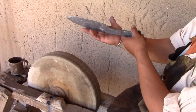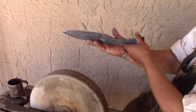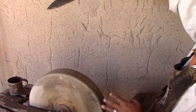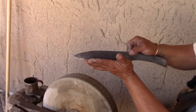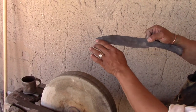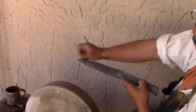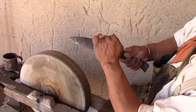You have to take into account the latent heat of the material. Once I get it to a straw color, I'll grab it with tongs and just quench this edge in the water — just this edge. That'll get it nice and hard and able to take a good sharp edge, while the spine will still be fairly resilient so that it won't snap.